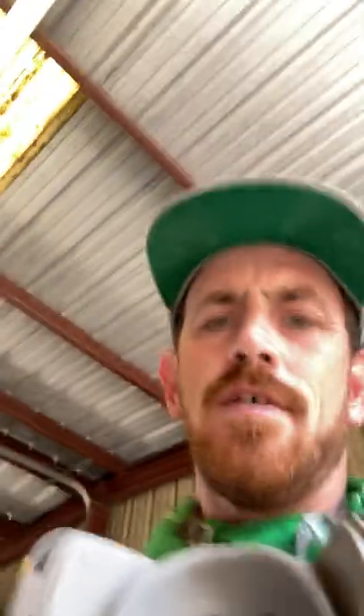Our tip is a 308 today. Fine Finish Low Pressure is what the FFLP stands for — it's a critical part of it. I do not like Rack 5 tips, I don't even like the blue Rack 10 tips. If it's not a fine finish tip, I'm not interested at any price for any of my work. I really like the fine finish low pressure tips, and I think that's one of the secrets that really helps produce a fine finish.